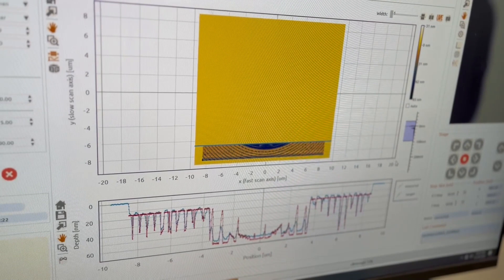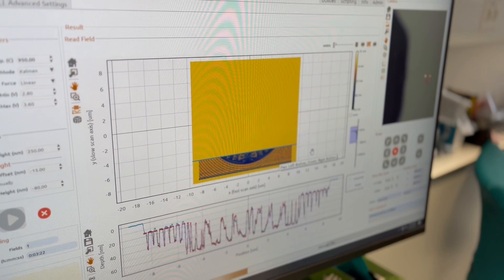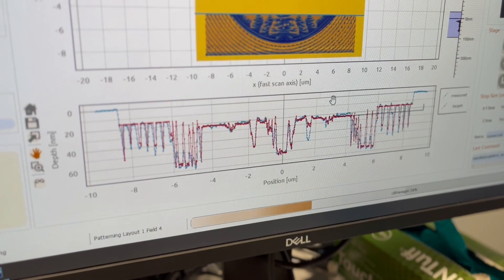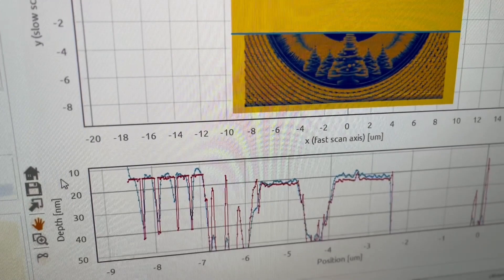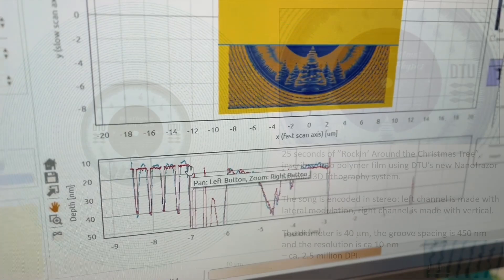You see this pattern slowly developing — we're scanning across the surface, writing one line and then reading the line as we come back, so we can measure it and feed back on our error. Down here is the comparison between the target pattern and the pattern we're actually making and measuring. The red line represents the ideal target pattern, and the blue lines are the measured pattern we're actually making with this probe. Looking at the scale bar, the errors are just a few nanometers, or even in the best case down to below one or two nanometers — so it's quite an accurate technique.